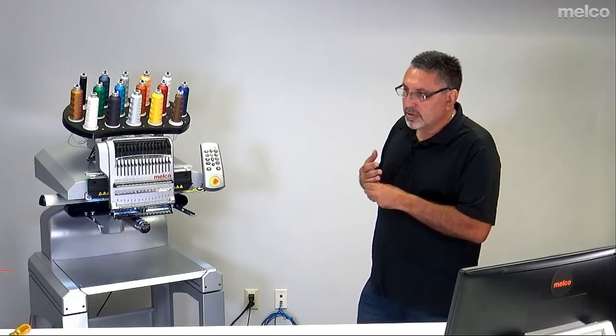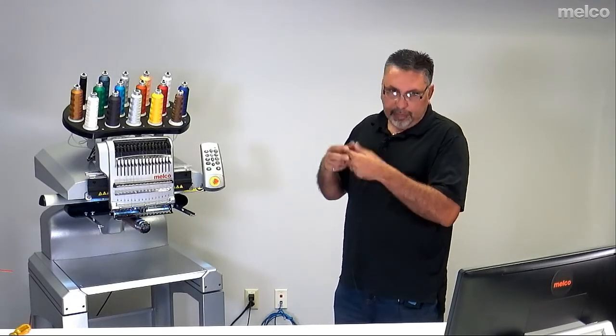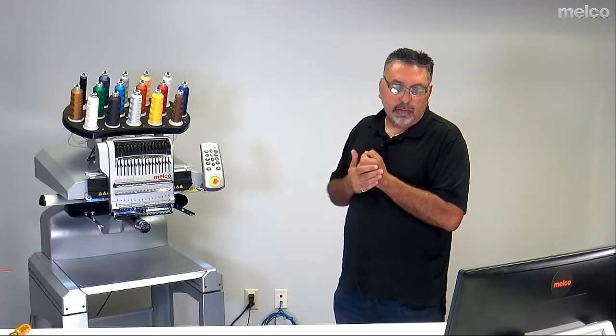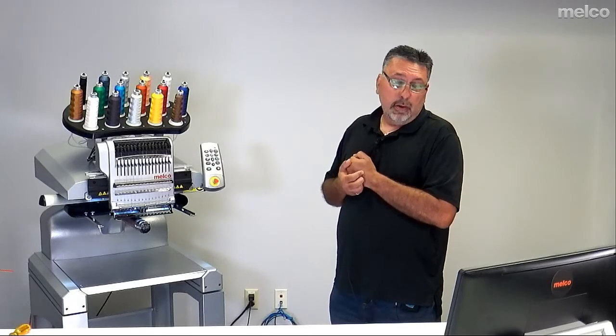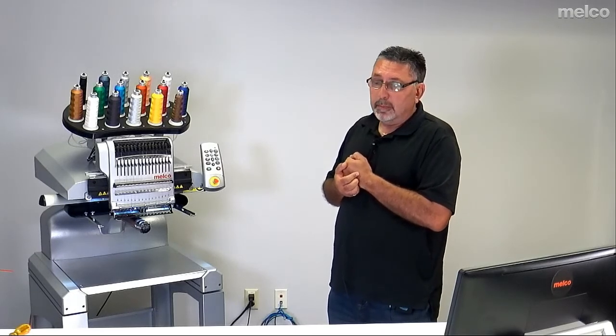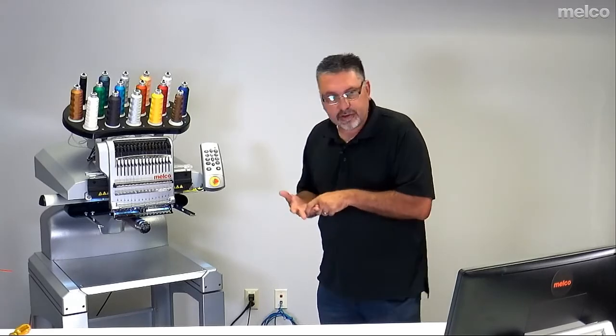And then one other thing is, if you're still having mistrims, examine the needle plate. Take that needle plate off, look underneath, make sure that all of the components are there, and it's lubricated and clean of excess thread and things of that nature.